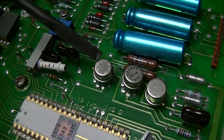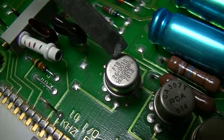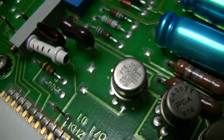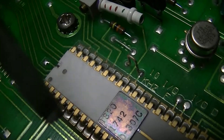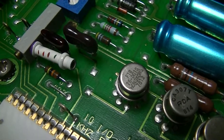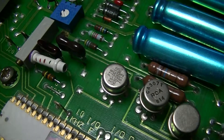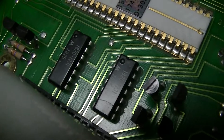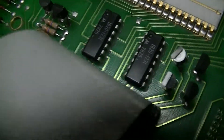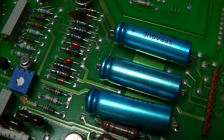There are a couple of other devices. This one is also custom branded — I'm guessing from the 'F' that it might be a Fairchild device. It's a 1826-0010. Most of the custom devices in this thing have an 8-digit part number that starts with 1820, 1826, or 1813, so they're all probably part of the same standard chip set. Two multiplexers for the LEDs on the display are both made by Motorola, as are some other devices, but they all have custom part numbers on them.